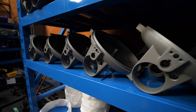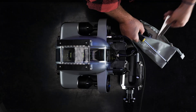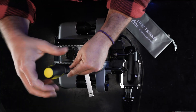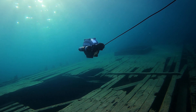The hollow space inside the DTG-3 ensures the unit displaces slightly more water than it weighs, causing it to float. This can be balanced by adding steel plates and blocks to increase its density. You need to add plates until the density matches that of water, making the unit neutrally buoyant, meaning it will neither float nor sink.